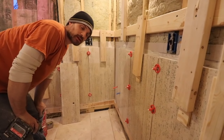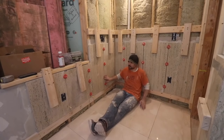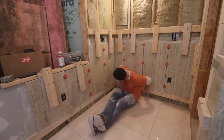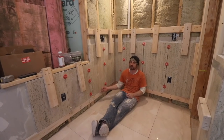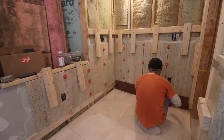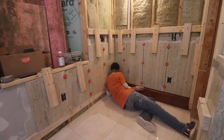I don't think I'm going to show all of these — I'm doing them all exactly the same. I'm just going to try to concentrate and see how many I can do, and I'll check in when I'm done. Every tile that you can see I got put on the wall today. I wouldn't say they're sitting perfect — some of them stick out just slightly more, which means I have a little bit too much thinset behind the tile, or I'm just not really able to squish the tile hard against the wall because that's quite difficult to do.